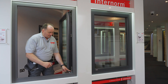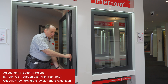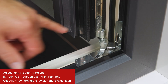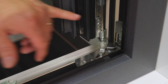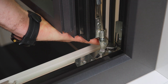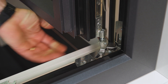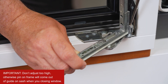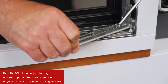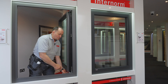The first adjustment is the height adjustment. Here you can turn the screw to the left to lower the window, or to the right to raise it. When you raise the window, it is very important to take the weight of the sash and then turn it, otherwise you risk destroying the head of the screw. Be careful when adjusting the height — the pin on the bottom might come out of the guide when you close the window, so do not adjust it too high.